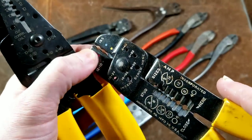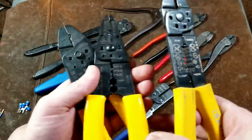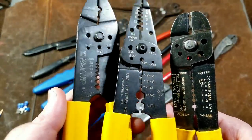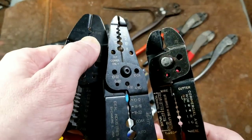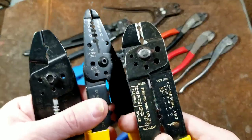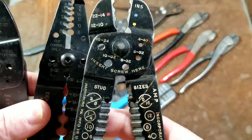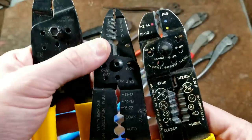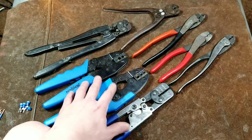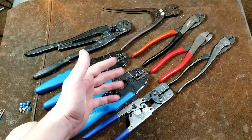The basic plate steel style has a couple of half-moon cutouts for different sizes — red and blue sizes there, yellow there — and then a spot for crimping insulation or odd size terminals. There are higher quality basic styles, and then improved styles such as these Ideals, where you have a different type of crimper button pushing downward, some integrated cutters, and a common imperial small fastener bolt cutter for the common size fasteners in electrical work. One has a threaded hole, another just has a plain hole to thread through and cut off the bolt.